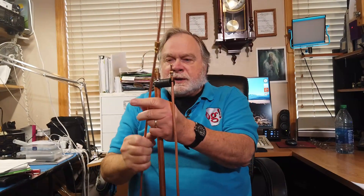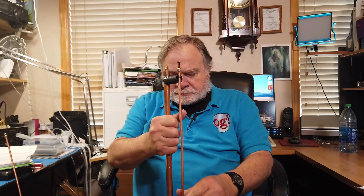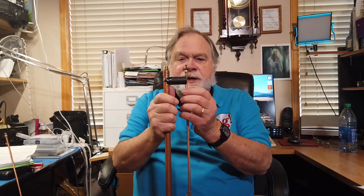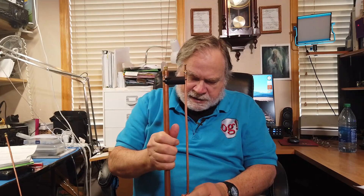We have had some pretty bad winds this year. I'd like to commend Ron Spooner for putting together a really nice antenna. This feed point is not unique — other people have tried it — but he has really made it work. He's got some nice little pieces of pipe to hold the right dimensions, and he's used little zip ties to hold things into place. It's just a really neat antenna, and as we could see, the SWR was very nice.